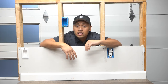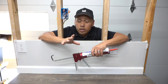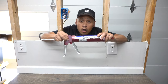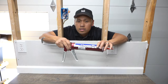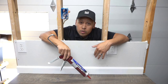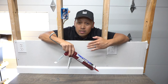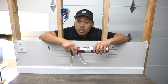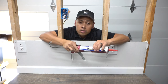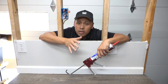At this next method, I guarantee you, friends, it's very easy to do. And that's by caulking the bottom of this baseboard. There are a lot of caulking types in the market right now, but for home inside use, I like to use this DAP stretch caulking. This is my number one go-to because it stretches a lot and it allows for expansion and contraction. Especially when you have floating floors or hardwood floors, over time that floor is going to move back and forth side to side. You want to have a nice caulk that can withstand that expansion and contraction. Take note that there are many different types of colors when it comes to caulking — I suggest that you use different colors and play around depending on what color your floor is.